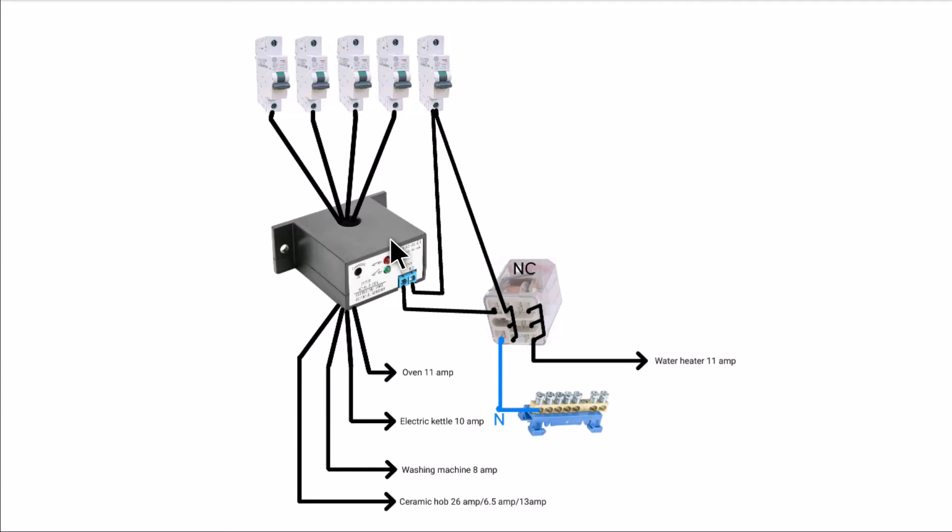This simple setup was perfectly adequate. You just take the wires out, pass them through, and put them back into the breakers. If they don't all fit through one current sensing switch, you can fit another — they're cheap enough — and link it to the same relay circuit. This one cost about a tenner. It's a fairly good quality relay; I'd recommend buying from a good supplier. I'll mount everything on DIN rail to make it really neat.